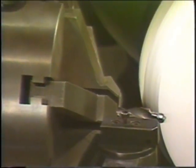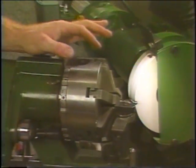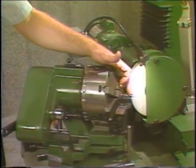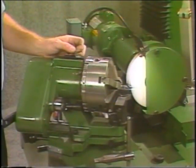There's another way of grinding the step drills. With this method you do not get an undercut. To do that, you would first use your angle dresser to dress half the angle on the wheel that you want on the point. Say if you wanted a 90-degree included angle on your step, you would dress a 45-degree angle on the wheel.